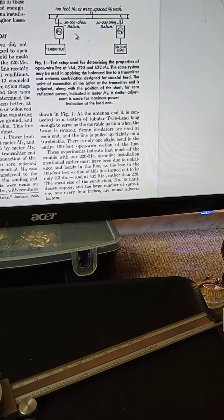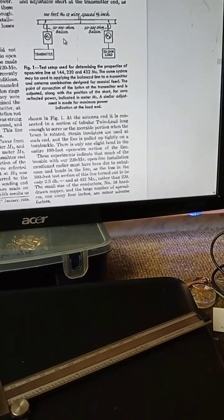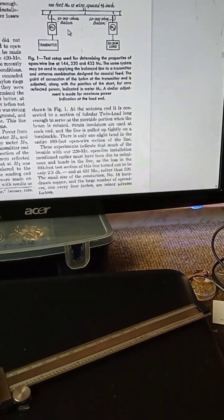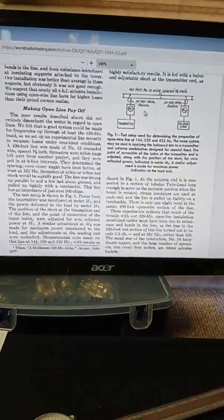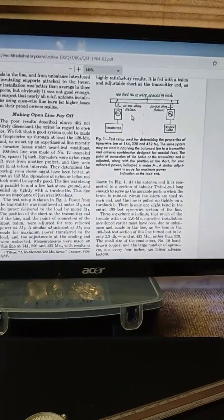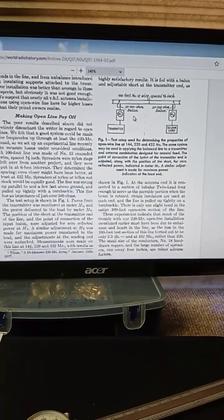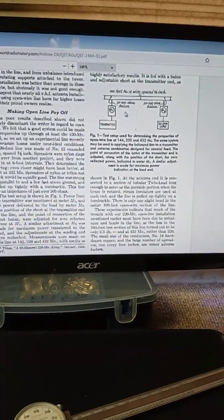2.3 dB at 432, so they went up a band. That's still severe losses. Put the transmitter closer to the blinking antenna. Isn't this obvious? And still, even this author who's getting most of it right is still blindly ignorant to the fact that there are horrifying losses between a line and ground. Ground is a horribly lossy dielectric even at HF.